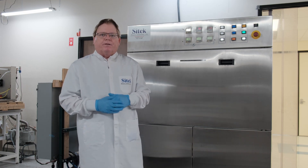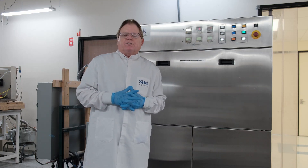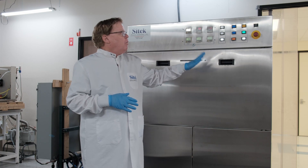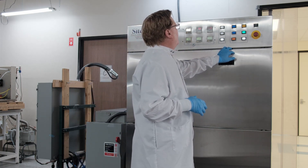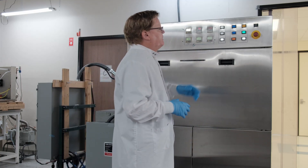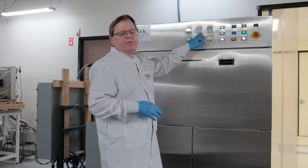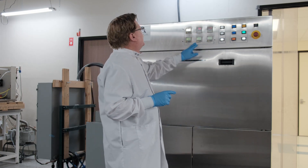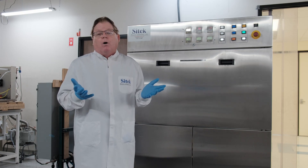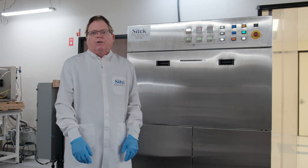This is Jim Malaney — I'm back. We're at the end of the process with one minute and nine seconds left to go. At the end of the process there's a built-in cool down timer that takes a few minutes, and it won't allow you to end until it comes up with 'process over.' One thing I need to correct — one of our process engineers pointed out that it does not do three washes and three rinses. It's one long wash. That's why it was five minutes: it does the surfactant spike, does a long wash for as long as you want — in this case six minutes — and then it goes through three rinses to rinse all the surfactant and any contamination out of the chamber.